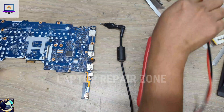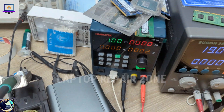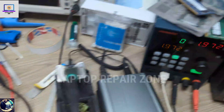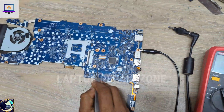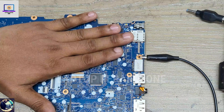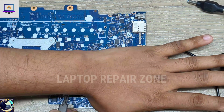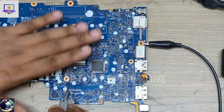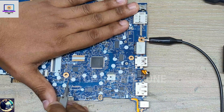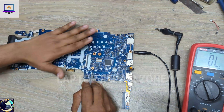Now I will try to find the fault by injecting power. I set 1 volt, with ground connected to ground, and inject here. As you can see it's drawing 1.9 amps — that confirms this line is short to ground. I check around the board with a thermal camera but nothing is getting hot.